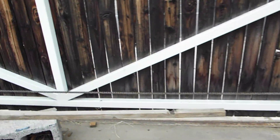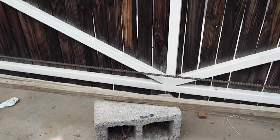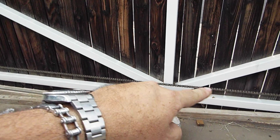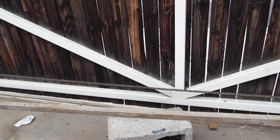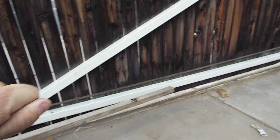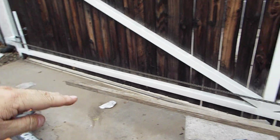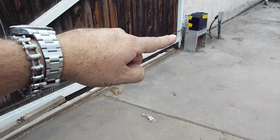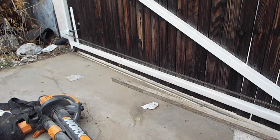The way to avoid too much tension is a technique I used when installing the chain. I had a bunch of 2x4s and blocks and shimmed them up so the chain, before it was connected on both sides, was resting on these elongated 2x4s the whole way across. That way you weren't trying to pull the weight of the chain when connecting at the bracket. I measured the height at the near end and carried that height all the way across, so I could connect and tighten accordingly.